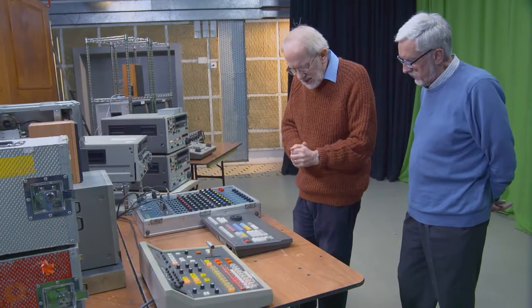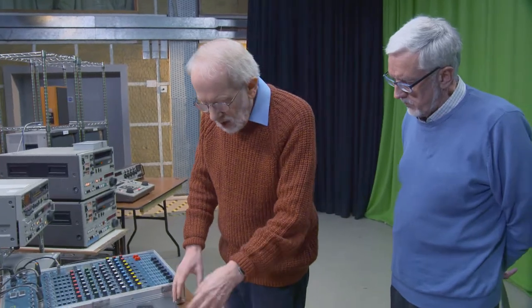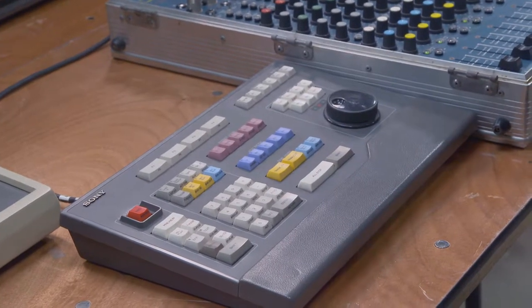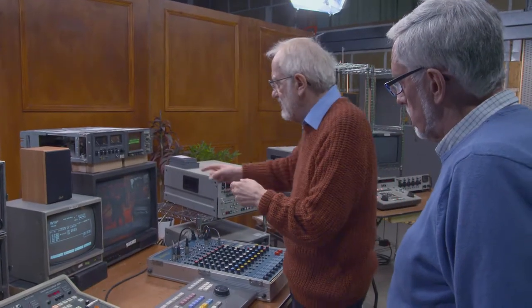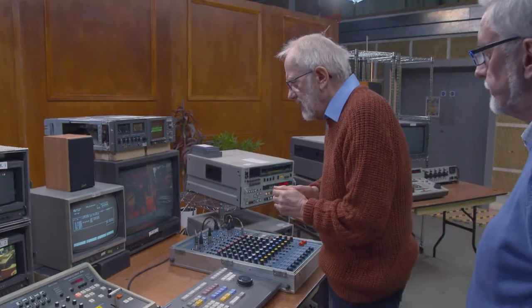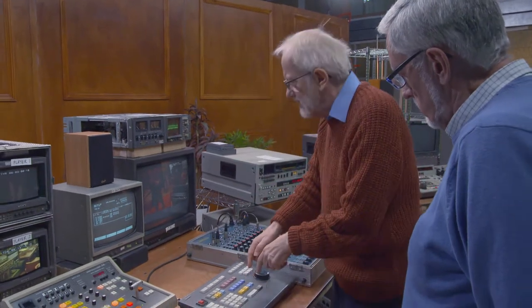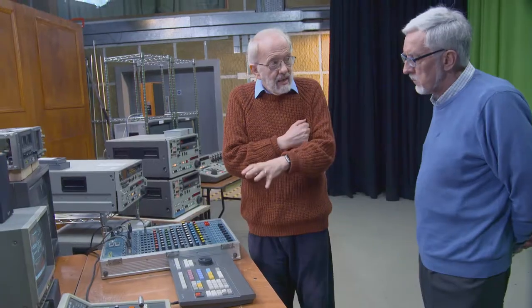And then I'd heard something about the 910, that this has macros, i.e. you can set up a whole chain of events dependent on which function key you pressed. And I got there was a manual with it, and I got it out, and started playing, and I started trying to write some macros. I realized that this whole business of us having to, on the ninth generation, go back to each edit, read the VITC, type the number into the player in, etc., you could automate with a macro, because this machine could interrogate the machine and read the VITC from the machine, and automatically put it into the player in. It could then move forward a frame, set the recorder in for the next edit. Suddenly it became a wonderful machine.